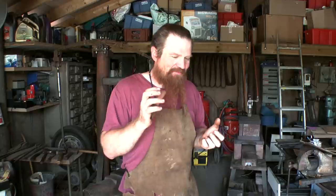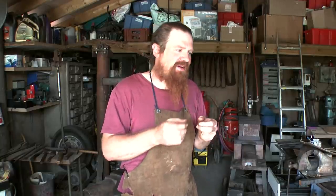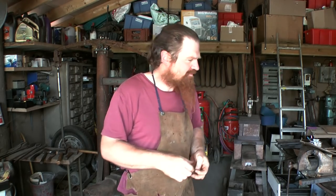Now that's all well and good, but two things there. One, I didn't really like working with sheet metal, and the cutting out of those little petals is dead fiddly. The way I've done it commercially is to send off the template to a laser cutter, and then you just get back basically a flower making kit. But the other thing that puts me off using that method is that you don't really get much texture, because the metal that you're starting with is so thin that's all you can work with, really. So you're working with almost a 2D material.